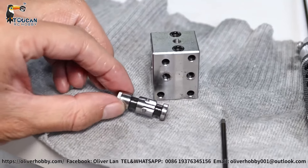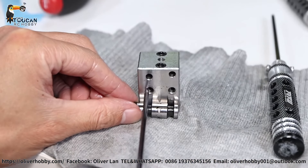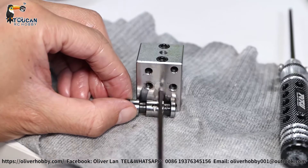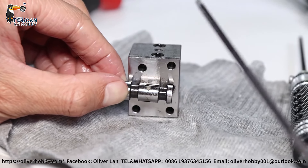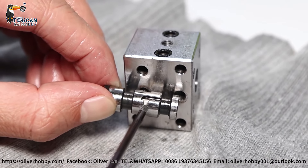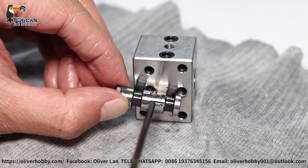So let's reverse to see — this valve inside should be in this position. The inlet is always connecting here, always open and leading to the next valve. The return line always leads to the return line all the way through — always leading to all the valve blocks. So imagine you can connect two, three, five valves together — in and out, it's always connected. Only in the middle, inside this hole, when the block's inner piston turns slightly, it's all closed. Imagine the hole is like this screwdriver — it's not open. When the valve piston turns to the hole position, the V-shape is now slightly open and the oil slowly goes inside. The V-shape turns and opens more — more oil going inside, more and more. Until this hole is directly aligned with the slot, and the full oil channel is now open.